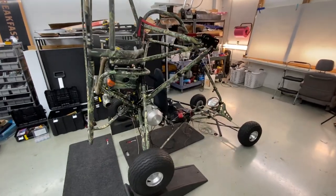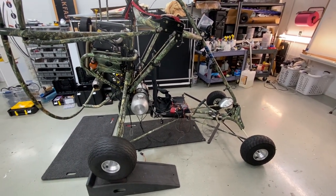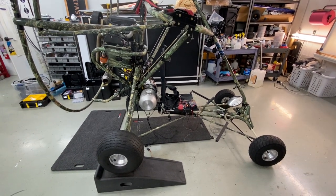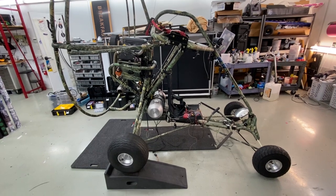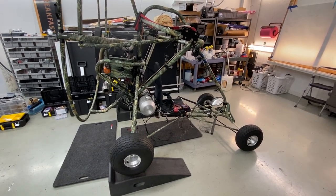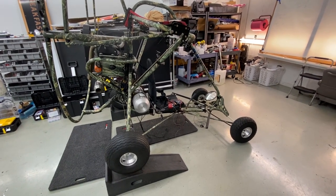In a nutshell, that's it — though it definitely feels like more work than what I just described. The instrumentation has been trial and error. The frequency module didn't want to calculate RPM correctly; this engine has two mags so we had calculations to do in the Banks module to display the correct RPM, and that was quite the challenge. There were also some defective items with the Banks module — a lot of shipping back and forth and tech calls. But she's really close — probably about a week away from being buttoned up, assuming no major programming issues.